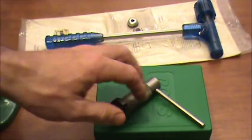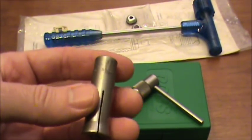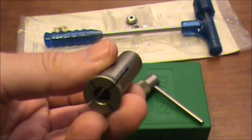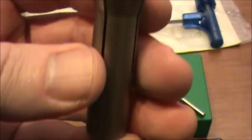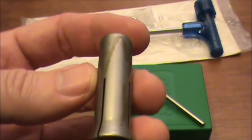In addition to those components, you're going to need collets depending upon how many calibers you want to work with. A collet is split and bored all the way through — the splits allow it to be squeezed closed. These collets come in a variety of sizes; you can look those up on the RCBS website. This particular one is a .30 caliber collet. They come in sizes like 22, 30, 32, 6.5, 35 — there's a bunch of different sizes. You'll need a collet for every particular range of bullet you want to pull.